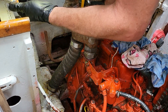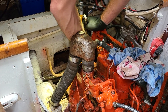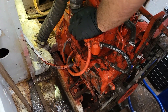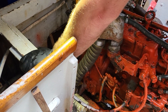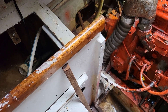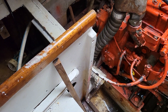Look, it's still good — there's a little bit of it. Scrape the cling on the edge of it. I wouldn't change that in this gear — I'd keep that one as a spare. There's not much else to really do. The only thing is to keep flushing that gearbox, but you need to get the universal joints all cleaned up before you do that. We're definitely smart to do that — get it all free, clean the prop and all that before you try, because you'll end up breaking something. It should be nice and free.